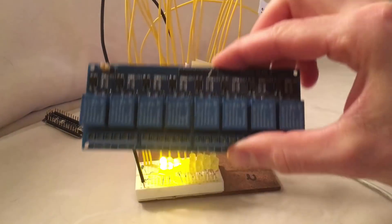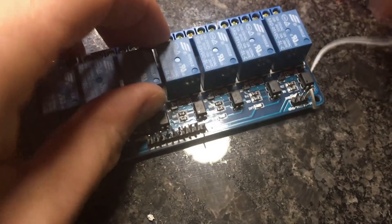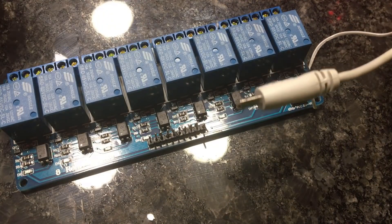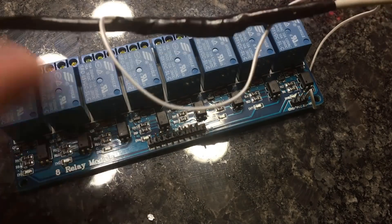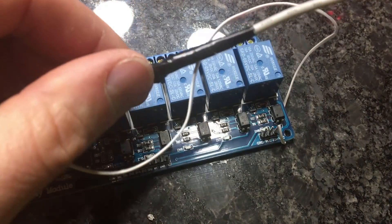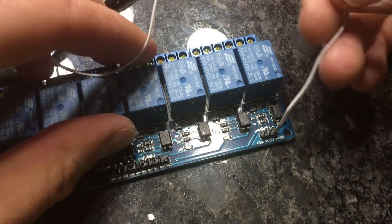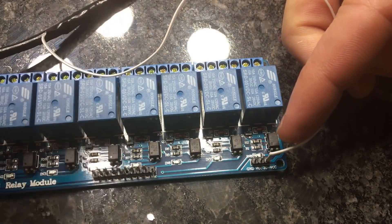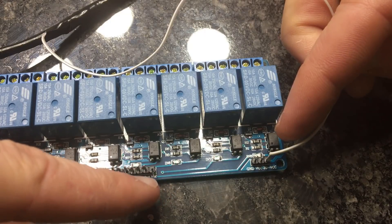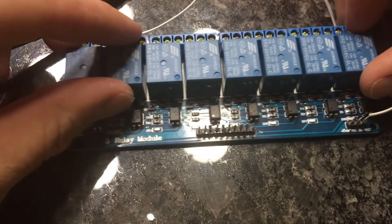These relays will do the same thing. I'm going to include a diagram on how to put this together. What I did was I took my USB cable, cut into it — the red wire inside has five volts all the time. I spliced a wire into that red wire, and that wire then goes to the power supply on the board, which is called JD VCC. You can also power it here at the middle jumper.